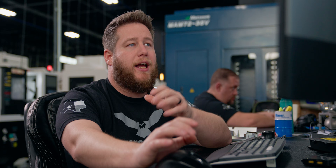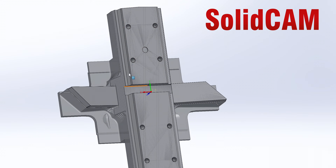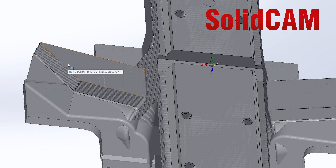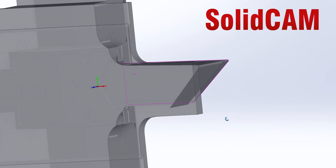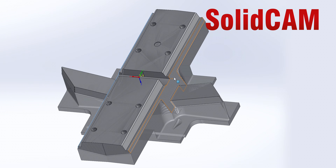As far as functionality goes, this is the operation that matters — it's what's bolting the two halves together, so dimensionally this side needs to be correct. We obviously need a way to locate the part when we flip it over, since we'll have finished dimensions. So we're going to face the back, drill and tap these holes, machine these shoulders, and finish the walls on this Chevy emblem as well as the side walls, so we only have to worry about the top side of the part.